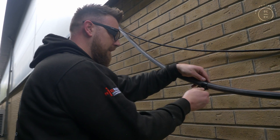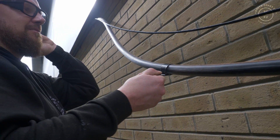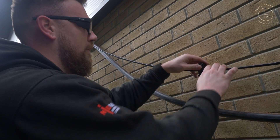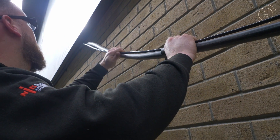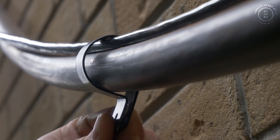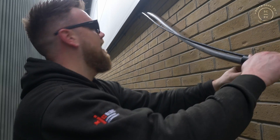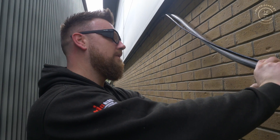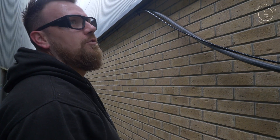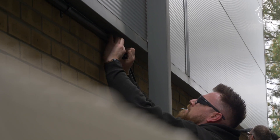These clips have actually turned out a bit too big for the cable - there's a bit of a void there. So rather than mess around going back to the wholesalers, what we can actually do is run the Cat5 screened cable with it, and then once that's around it, it's now a nice snug fit - not too tight that it's pinching the Cat5 or the armoured. I'd say it fits perfectly. We're probably halfway with the clipping - it's about 80 meters so we've got a clip about every 300mm.